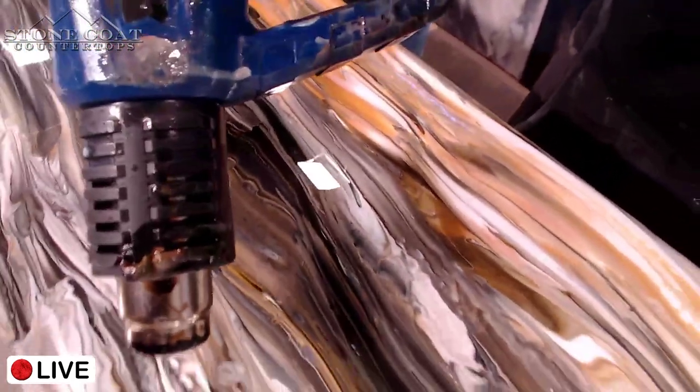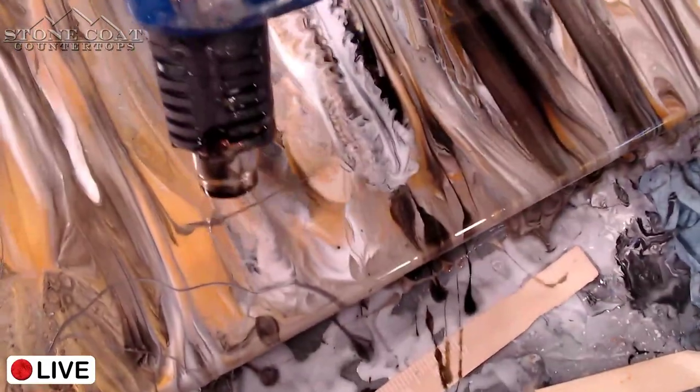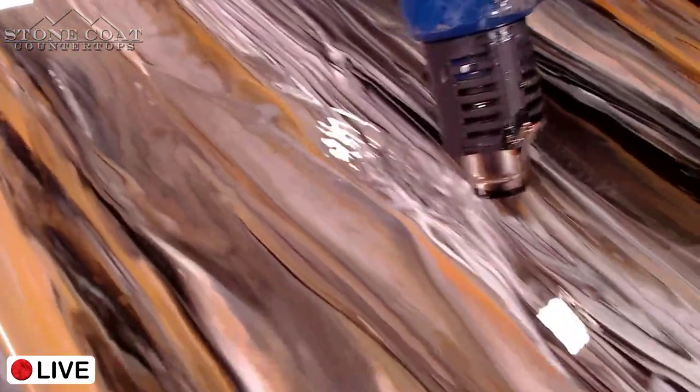Mitch, you come record it. The best material to pour on is anything that looks really ugly. We love to take old formica, laminate, solid surface, tile, these kind of things, and up-level them and make them look brand new. So we went over MDF here, and that's just fine because it's inexpensive, and it's the same material all the way through.